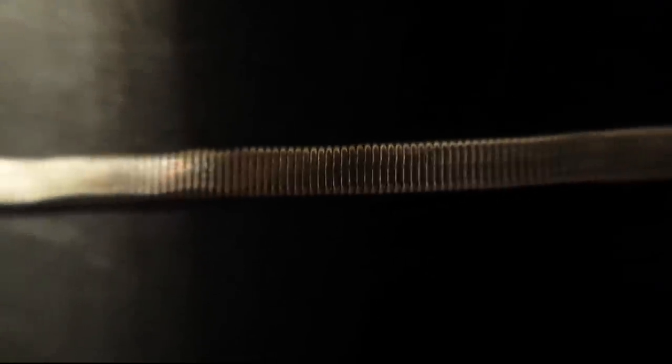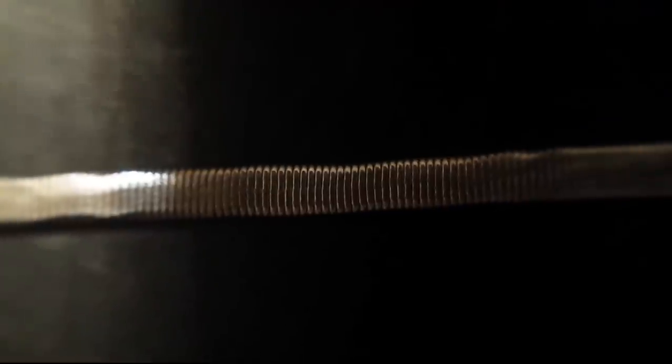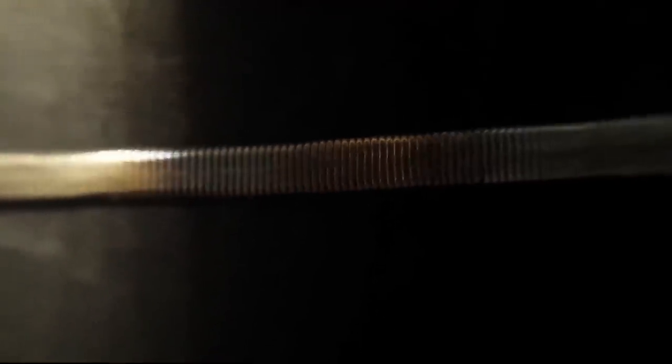And you'll notice this side is pretty marred up. But if I turn it over, it's going to be the side that I actually was using that chrome-plated hammer on, and it gets it really shiny. And so, personally I like to put that shiny side to the outside so you can see it. But yeah, there's some more imperfections, and so I also like to go back over again after torching it straightened, and just hammer it one more time just to get all of the imperfections out, or get it as even as possible.